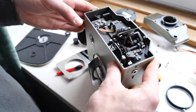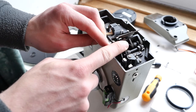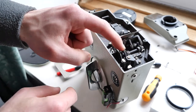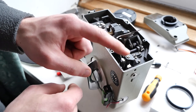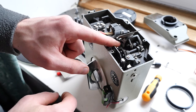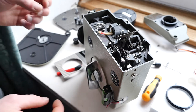For crystal sync, driving it with a stepper motor, I was thinking of somehow getting a drive shaft in to the side of the camera to drive this gear here which I've got my finger on, because for each frame this seems to do one revolution.